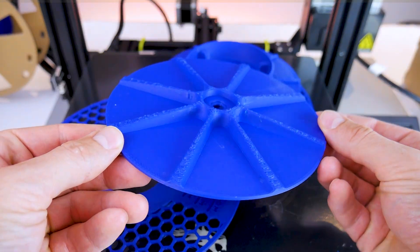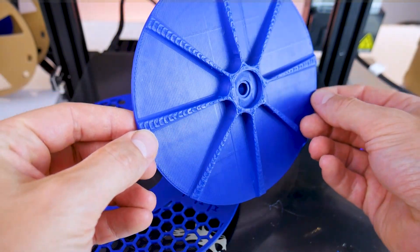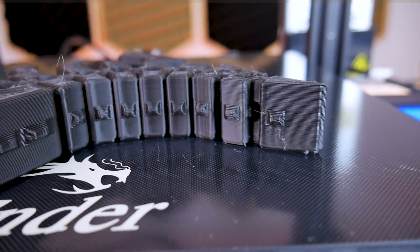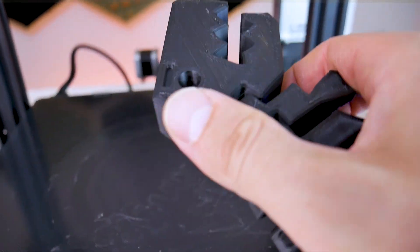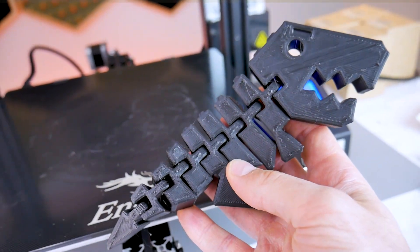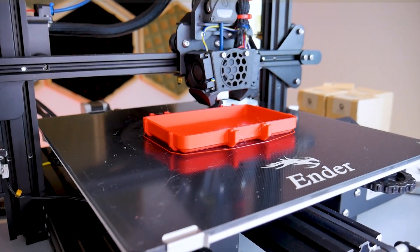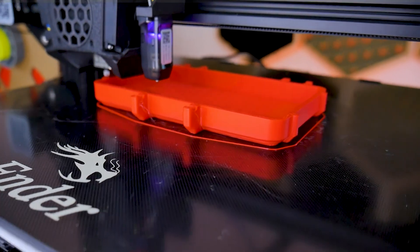All of these parts were printed with a 0.6mm nozzle at 0.4mm layer heights, so features with steep transition angles look pretty chunky — that's obviously a function of those taller layer heights. I thoroughly enjoyed my time printing with all four rolls and any parts that had articulated joints, like this flexi-rex, came out just fine. The tight diameter control on the filament ensured good dimensional accuracy, and none of those articulated joints ended up bonding together. On the snap latch cases, all of the functional hinges and latches are still operating perfectly after many cycles of being opened and shut.